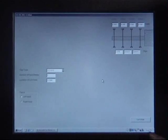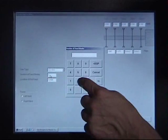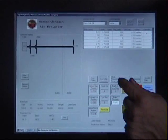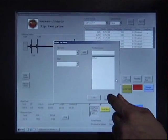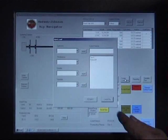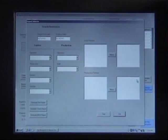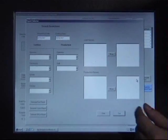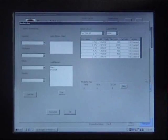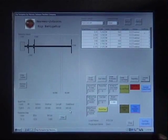Parts are entered into a database and include part width and the option for minimum and maximum part length. Once preset production part quantity requirements have been satisfied, the system can automatically eliminate the requirement from the solution base. A part in the cut list that has the minimum and maximum length information will provide that RIP width only if the length criteria are met. This greatly reduces the requirement for re-RIP or additional downstream processing.